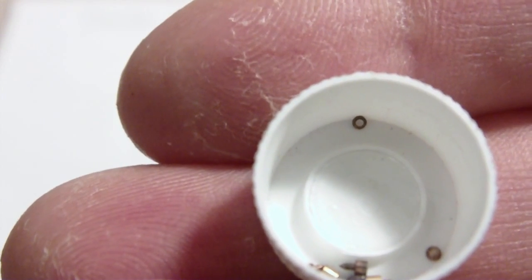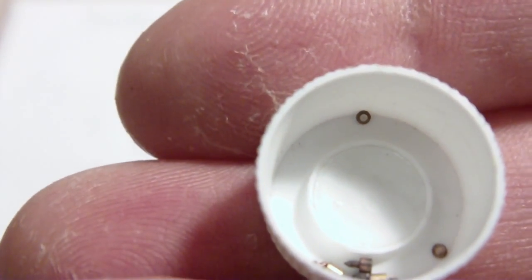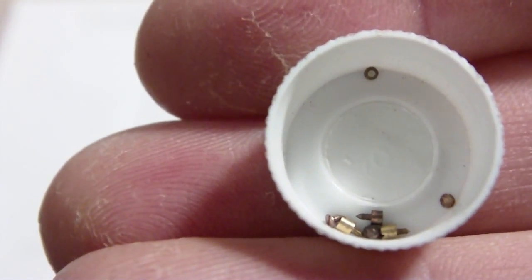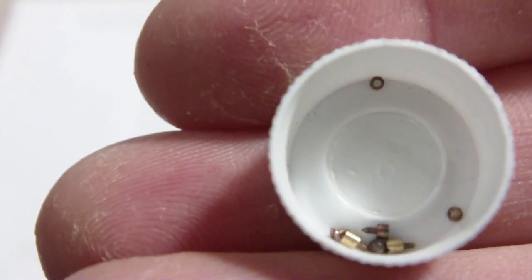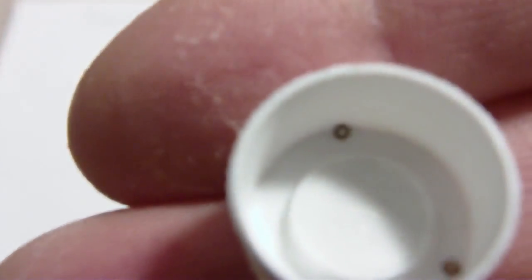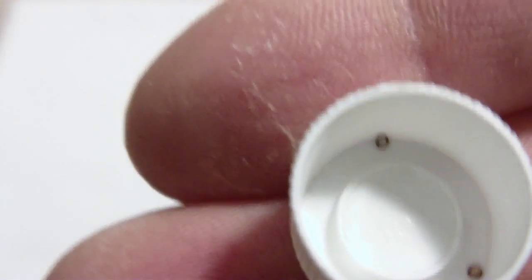You would add washers. They come in different thicknesses, and there are different diameters depending on the size of your weight. And other things in there are just screws. I have balance screws lying around. Well, not really extra, I took them off another watch. But yeah, you'd add a washer to make it heavier.